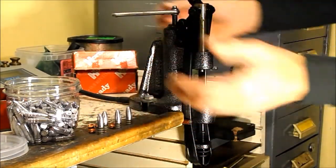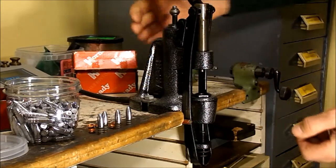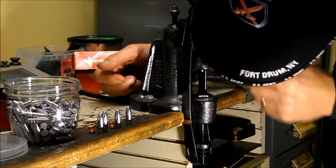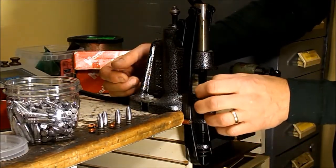Lovely. And when we're done, take off the ratchet, maybe a half turn, and just back the pressure off the lube in the reservoir here. Otherwise you'll come back and find that it's spewed out around the bottom and up the top there as time goes by, as it wants to try and escape all the pressure that you put it under. And that's all there is to it.